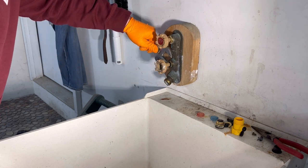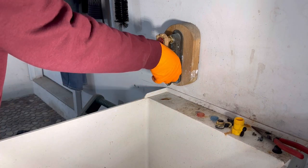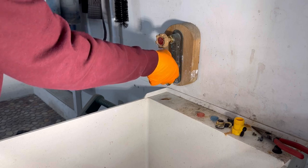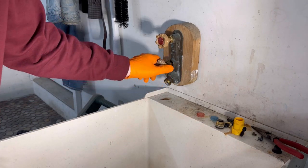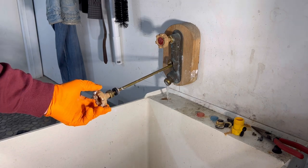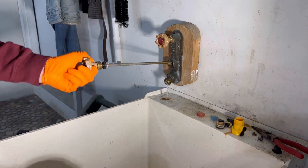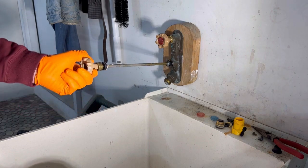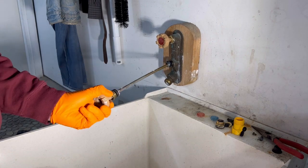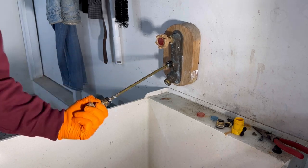This block isn't really secure to the wall that well. Alright, so this is the packing nut — take this out, then you unthread it the rest of the way and pull it out. There's a rubber check valve right there, that'll kind of hang up a little bit. Just wiggle it and it'll come out. Wiggle it, turn it, pull it.